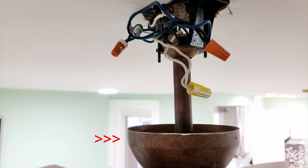The first thing you need to do is remove the ceiling cover. Most of the time it's just two screws that you loosen and then it slides straight down. This will expose a bunch of wires — don't be intimidated. All you have to do is remove each of the nuts and remove the old fan controller if there is one. Before you even work on this, make sure the fan switch on the wall is turned off. Or if there's no fan switch, go down to the circuit breaker — most likely in your basement — and turn that off. I definitely don't want anybody to get electrocuted working on this project.